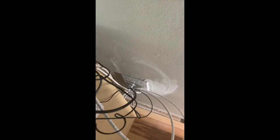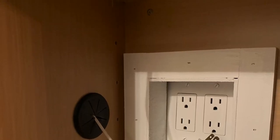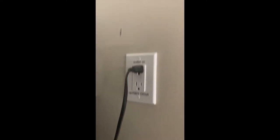There were two outlets along this wall on either side of the TV. I changed each of those outlets from a single gang box to a double gang box, making each of the two plugs become four plugs. Then I decided I'd set these cabinets one and a half inch off the wall to create accessible channels for cords and make each outlet accessible by cutting holes in the back of the cabinets. I also wanted to have an outlet right behind the TV high up on the wall, but I didn't want to add it to the same circuit where I already added those other outlets. So for this one, I ran it from the circuit in my bedroom down the wall.